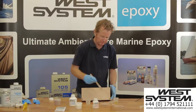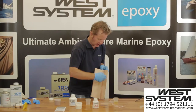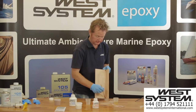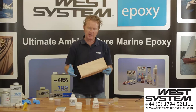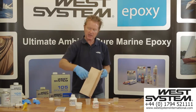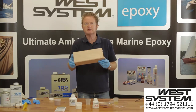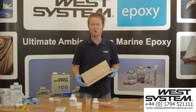And we can brush the resin and hardener mix on, and you can see the plywood changing colour as the resin and hardener mix wicks in. Now we would want to do this and then leave the coating to tack slightly. And the reason we leave the coating to tack is that we want it to grip our fillet and not allow the mixing stick and the filler to skid over the surface, which is what will happen. So we can go around and prime a work area in 10-15 minutes, walk away, have a cup of tea, have a break, and come back to this in a short while.